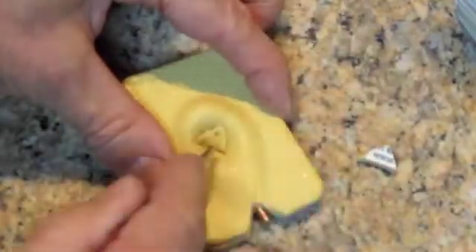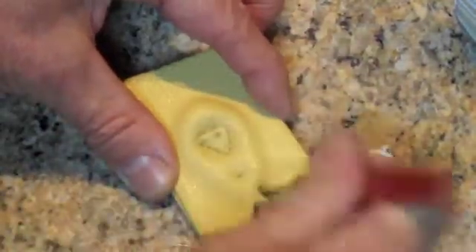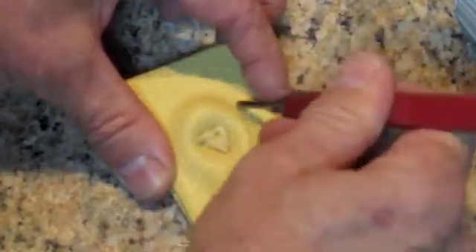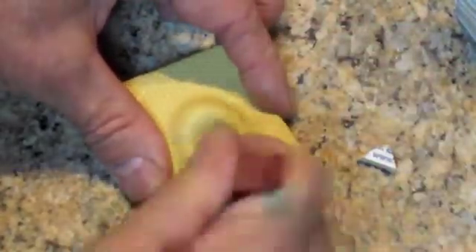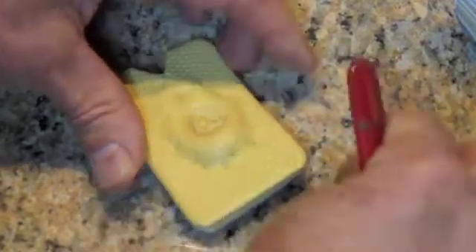Tacking or stitching it together using an old mold knife, doing your best not to push the mold knife handle up against the metal of the model. You can scratch it quite badly, and of course those scratches will end up in your mold and therefore end up in your castings.